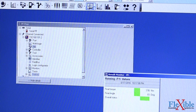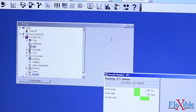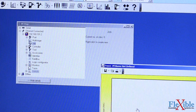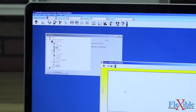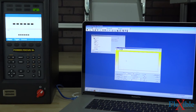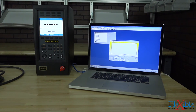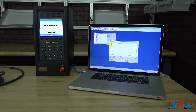We could open up the Statistic Viewer — you can see our P-Set that we had set here. We could open up our Trace View. We could do all this kind of good stuff through the software instead of having to do it on the controller. This also means that you could control your PowerFocus controllers from anywhere on the network, anywhere you are in the building. You don't necessarily have to be on the controller to make changes. This helps a lot with the compact model that doesn't have a full keypad and full screen.